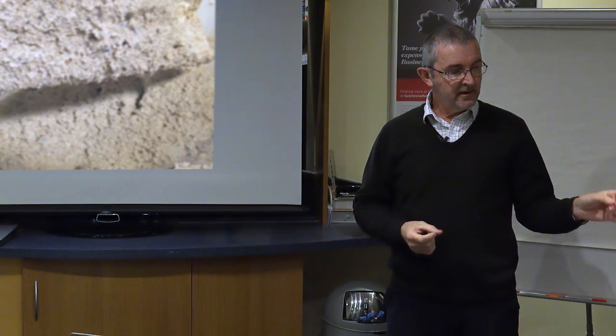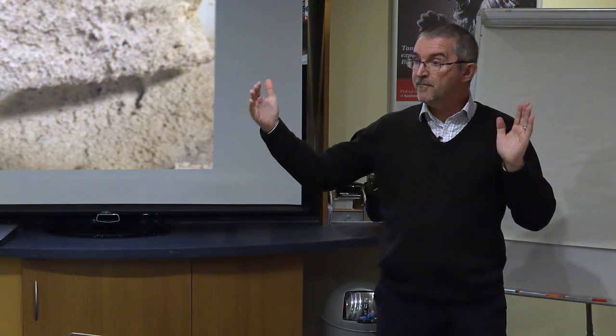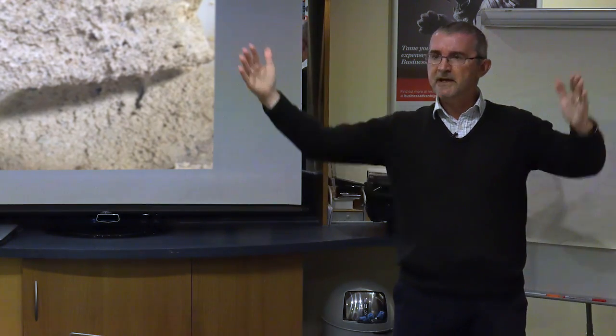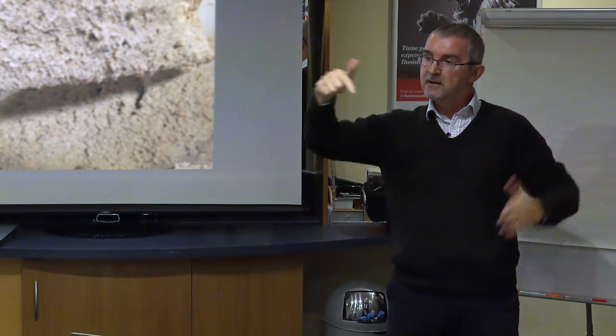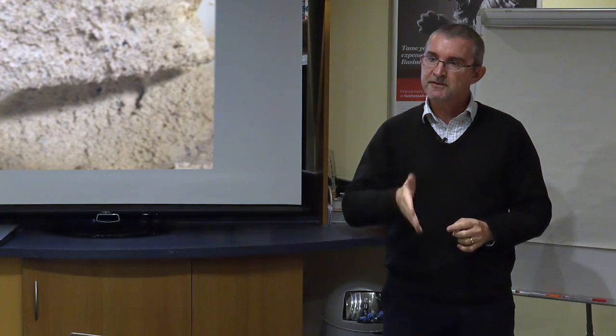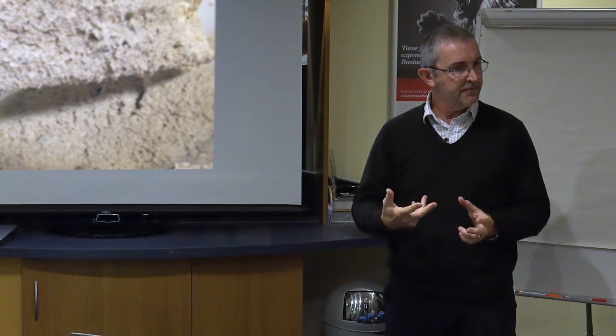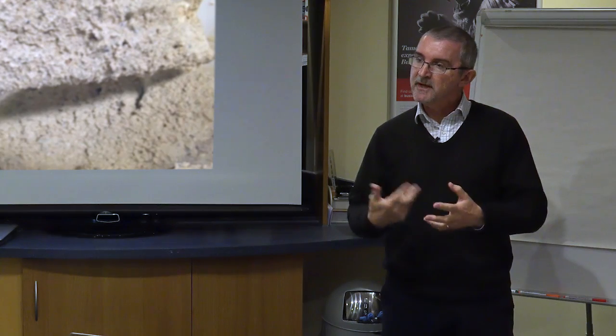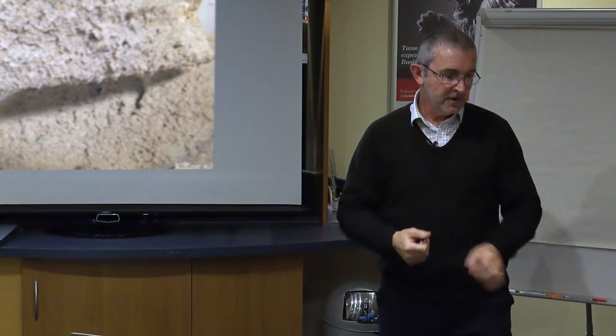A non-hydraulic lime like that, if you had it in some very large historic garden walls, perhaps around a country estate, which could be 3 feet thick, the lime in the middle of that wall, that could be 300 years old, it will still never harden, it will never go off, because it's completely isolated from the air. And hydraulic limes you could set underwater, because they require the water to harden.